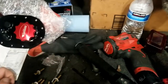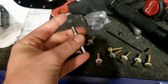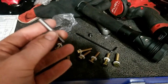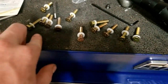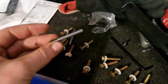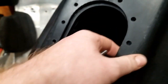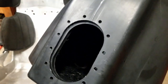Now we're gonna do the top cover. They give you these studs for the tank install and top plate install, which is really handy because doing this without these is a bit of a pain. You can make your own — just get the same thread and cut the top of a bolt off — but it's pretty cool they actually give them to you. We've got our grade 8 hardware and nylon washers on top for the top plate. Now we're gonna install our guide dowels into the bladder housing, which has rubber inserts inside it, to line it up and then put the top plate on.